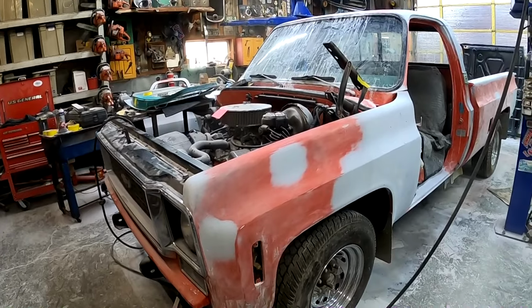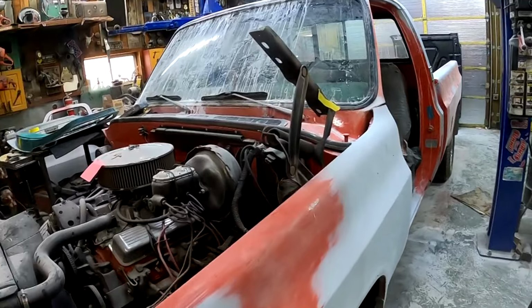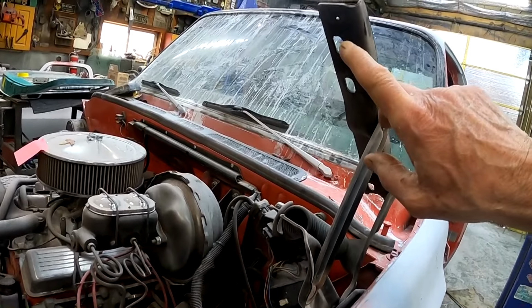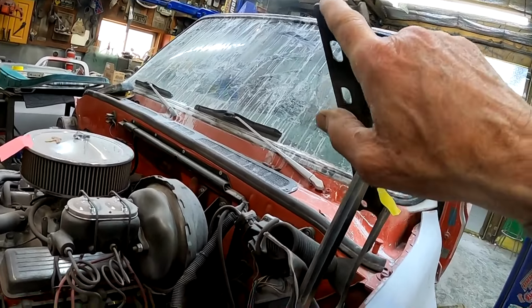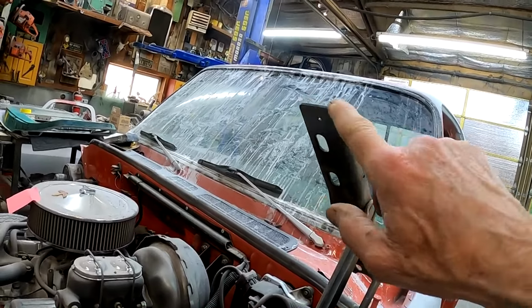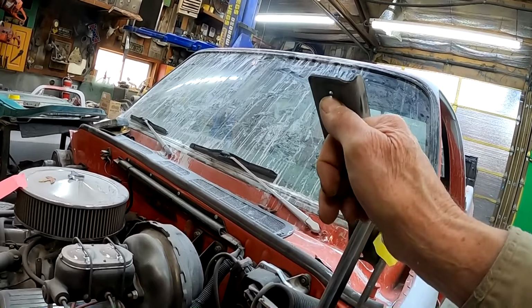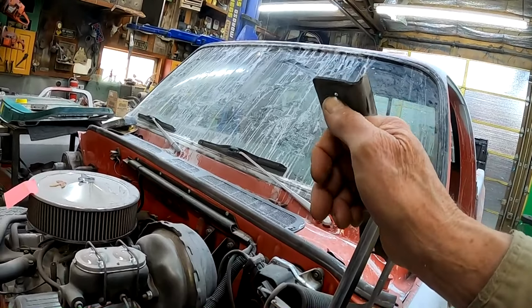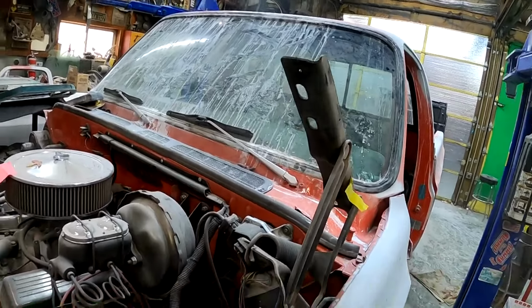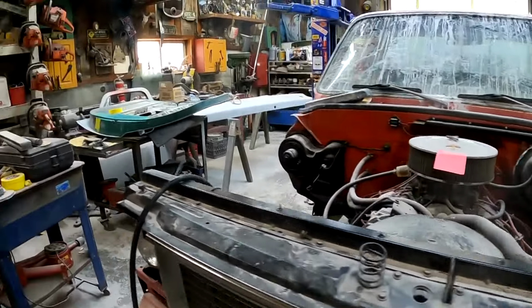And I just dread taking it apart because it's got everything fitting, but you know, the door gaps and all that. But Harmon has got me drilling these little alignment holes. I always just marked them around here, you know, the hinge with the black marker. And yeah, you can get real close, but when you drill a hole, it's a certain size, a 1/8-inch drill. And then when you put that drill back in there and got it set, boy, it's exact, you got it right back where you had it. So everything lines up.